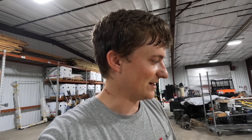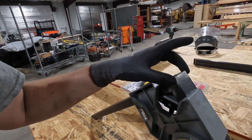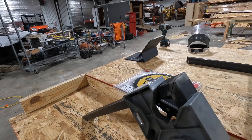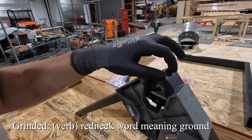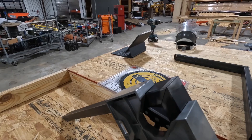Justin abandoned me for the night - his wife is in charge. So here's the deal: I got our mitered corners cut, I ground off the coating on the steel down to pure steel, and we're ready to go. So late last night I finished tacking up the frame, and I'm walking back there right now so we can go take a look at it.